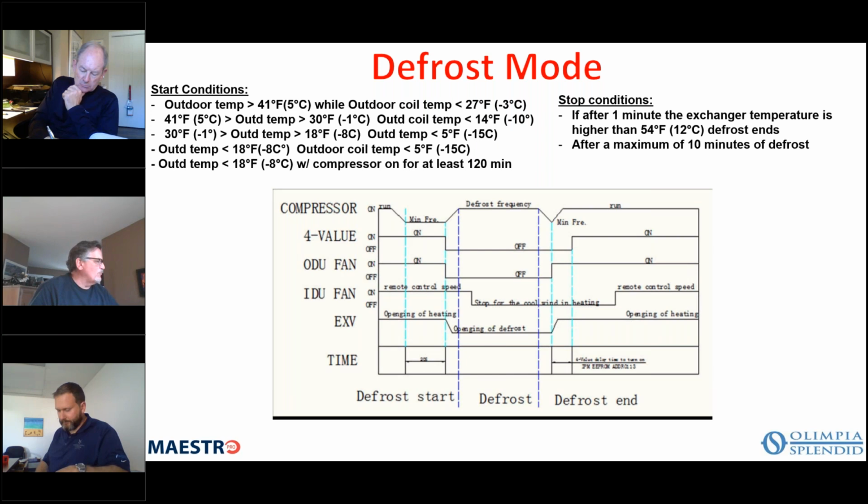Okay. So the last section here that I would have gone over is the troubleshooting, which again, depending on what code you have, there is a sequence of operation that it suggests that you take. So for instance, if we had, let's call it a flash code 16, internal exchanger or indoor coil temperature too low. If the sensor detects for more than 5 minutes a temperature lower than 28 degrees, that's considered an issue. And then the action there is to check to see if there is an abnormal temperature drop of the indoor coil. And if the temperature is within limits, check the temperature sensor.